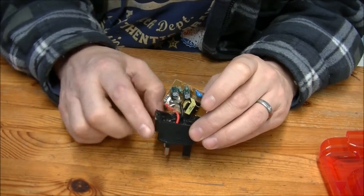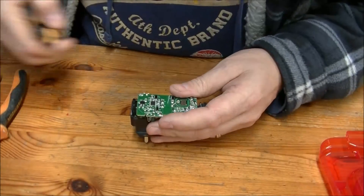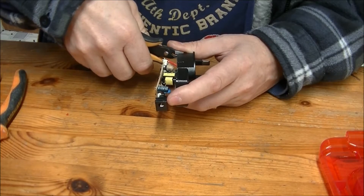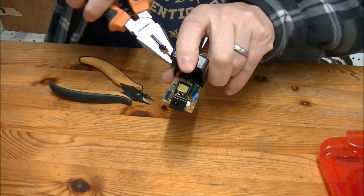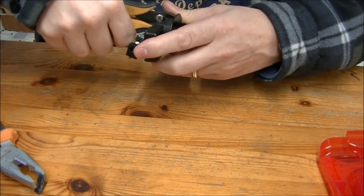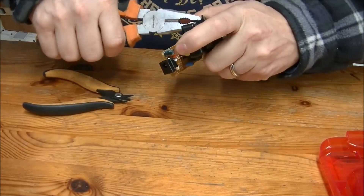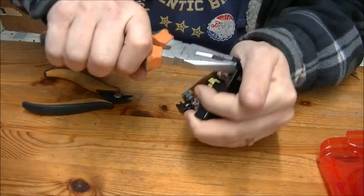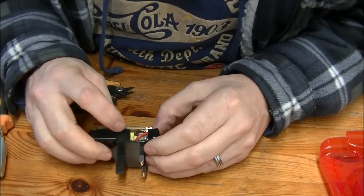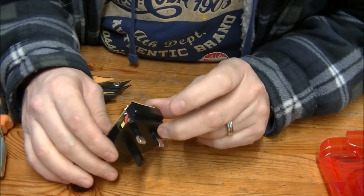What I'm going to do is just cut the side out of this plug and then we'll have a look at the clearance on that. Okay — so yes, that capacitor definitely clashed with the neutral, and that was why it went kaboom. Something to watch out for in future, I think.